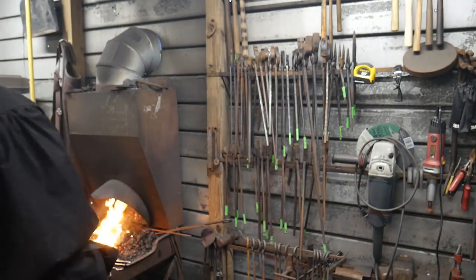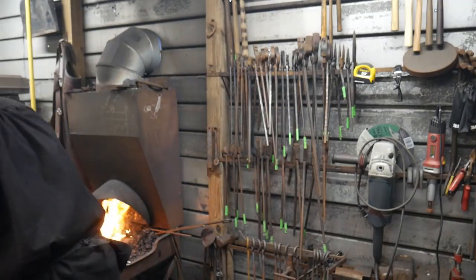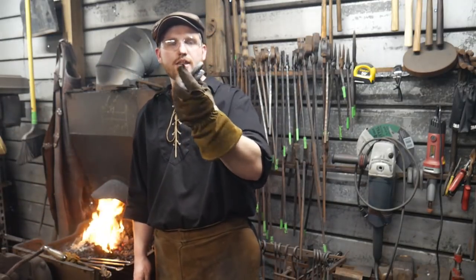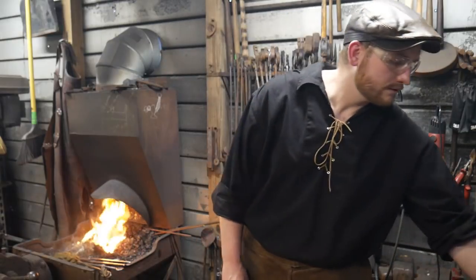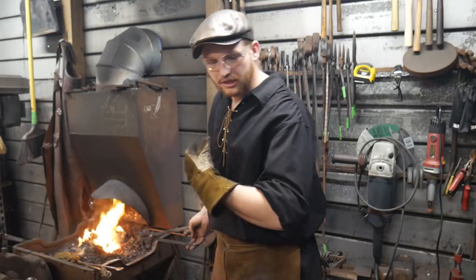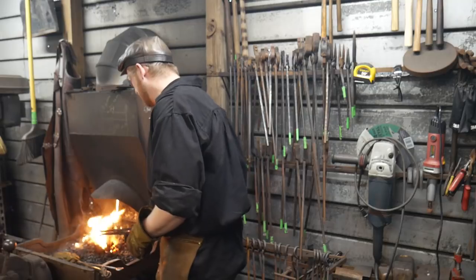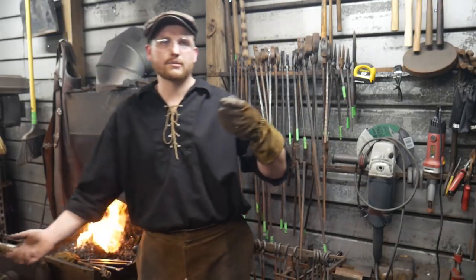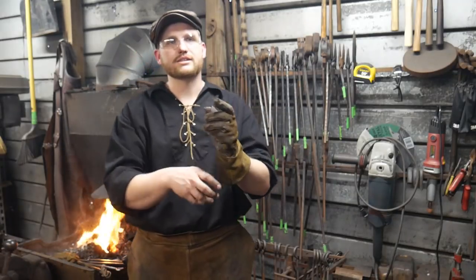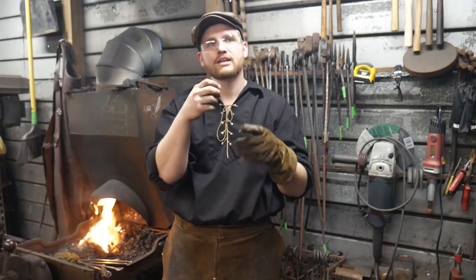So you have a bunch of little short, stubby ones to start with. Then you add them up as you go. So we'll take and weld these two together on this link that I'm prepping. The big trick is you don't want to burn your other links while you get this one welded. You want to keep those out of the fire, and the links become a bit of a shifting around, annoying thing until you get a length of them where they dangle by themselves naturally.